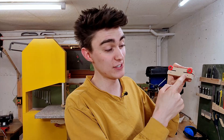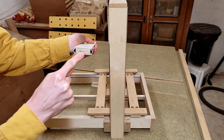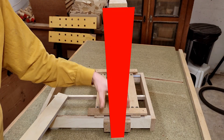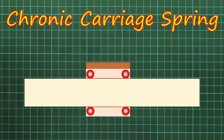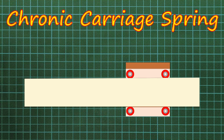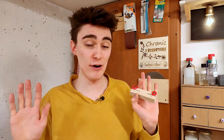Because there's probably at least one person out there who hasn't understood my intention behind mounting the roller bearings on springs, this is actually a good time to explain it. Using wood and the associated equipment to shape wood, it is utterly impossible to get these two separate aluminum rails paralleled down to like a hundredth of a millimeter — these two edges the bearings ride on will be further apart in some places than others. They may even be wavy or bowed out or in. So by mounting two of the rollers on a spring, I can adjust them to be snug on a narrow section, and when the carriage moves along the rail, the spring compresses for the wider parts instead of the entire carriage getting stuck and hard to move. I came up with that design all by myself, and I'm actually pretty proud of it. If anyone steals it in the video without mentioning me, I'll be proper pissed.